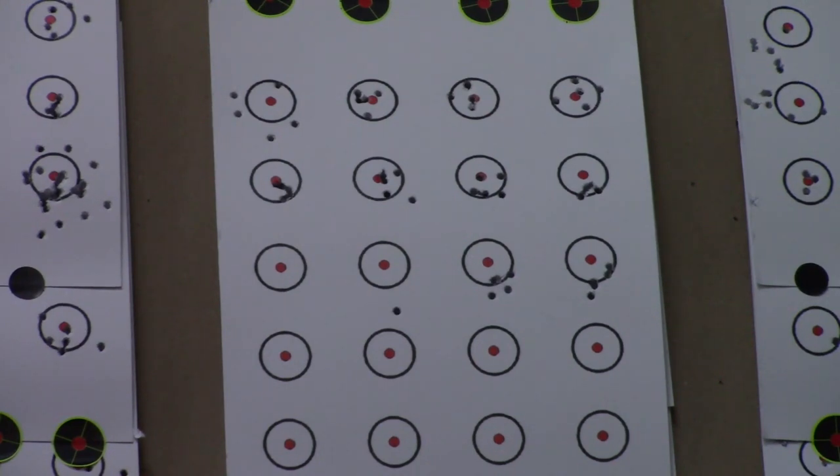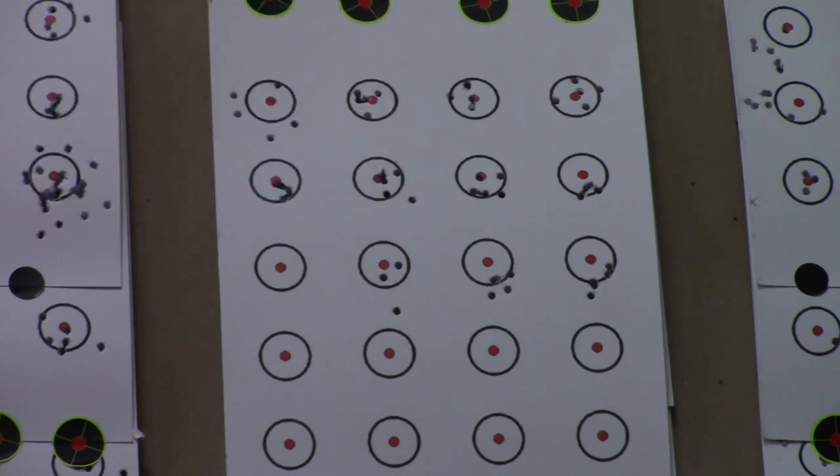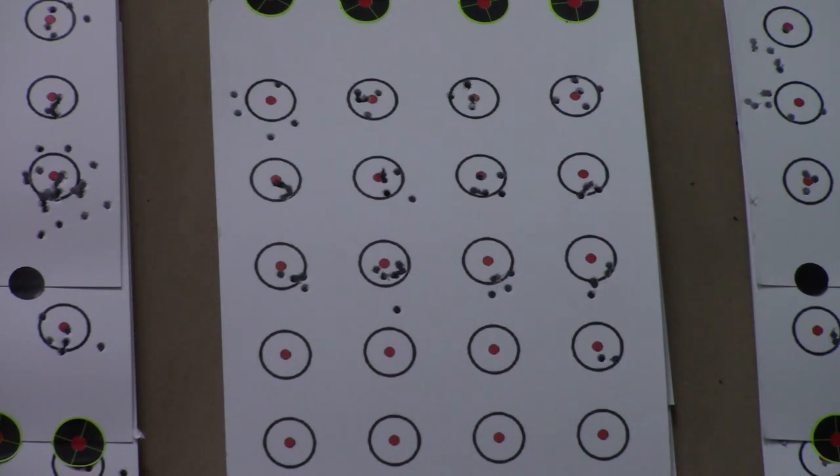As you saw at the beginning we did have the chrono set up and we did do a full shot string of the rifle. This particular rifle is the Katran C, the compact version, and it's .177 calibre. From a 250 bar fill we were getting around 89 shots, although this is only a 165cc air cylinder so not a fantastically high shot count, although I'm confident we can improve on that. Over those 89 shots the maximum feet per second deviation was 13 — over a whole shot string that's nothing to be sniffed at and I'm happy that the regulator is working as it should, but I'm confident with a little bit of work we'll be able to increase the shot count and shave a little bit off the extreme fps deviation.